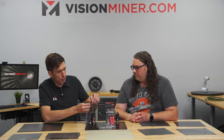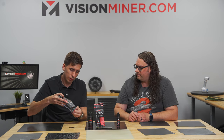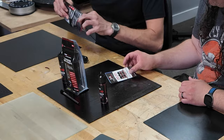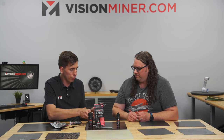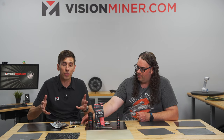Say you're going to print a big batch over the whole plate — you might as well, especially if you're printing like PLA or PETG, just coat the whole bed. The craziest thing about this on glass: I personally did over 45 prints in PETG of the same part over and over. You let it cool down, it pops itself off. Sometimes you hear it in the background and you're like, 'oh, that's done.' You can use it over and over — on certain PEI plates I coat it once a month and just keep printing in PLA.